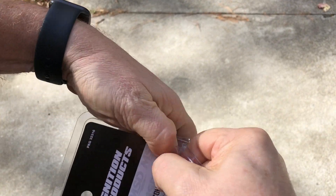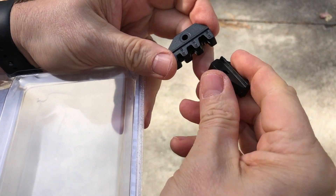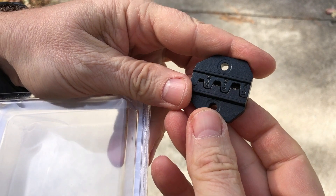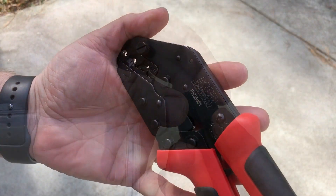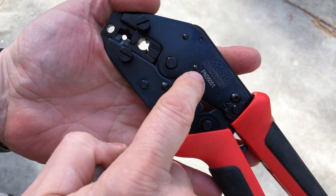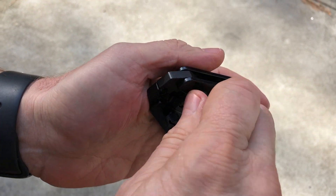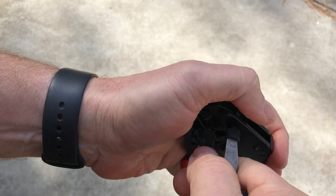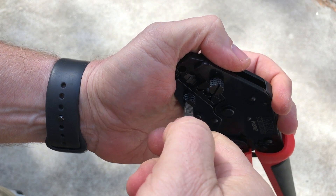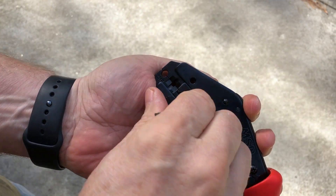Just need to get through the anti-theft plastic welding they do on these things. So basically, you just get a couple more of these dies that go on the upper and lower jaws that you use to crimp those types of connectors together. Let me grab a screwdriver and we'll swap out the dies. I didn't mention the part number on this - it's a 35051. I'll put a link in the description for this and the particular die. Just out of the box, these things are on really tight - you should be able to get them off by hand, but they're on super tight when initially manufactured, so I just need a screwdriver to help out here.